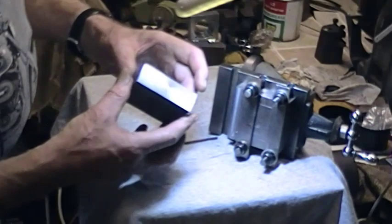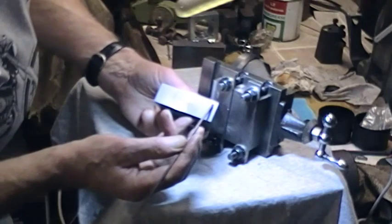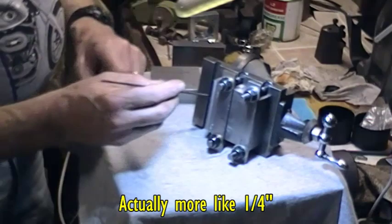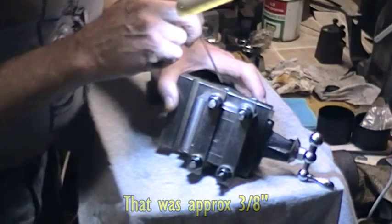With two of those the object of the exercise was to make a sandwich, so with one on top of another — this is still in the vertical slide since I was working on it — one piece was going to be machined out by half inch all the way around, that's about three eighths and a half. And this piece, again half inch coming in, but the depth on this one was about five eighths.